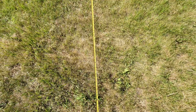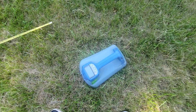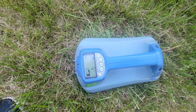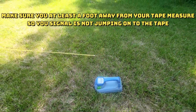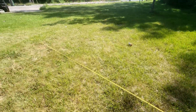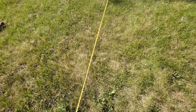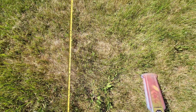I'll check my depth — I'm going to sit at the 10-foot mark and go to the box. I'm at 8 kilohertz. I'm roughly about a foot away from the tape measure — you want to be a foot away so you're not picking up the tape measure and the signal's not jumping out to it. I'm on sound mode here, and we'll set it at the 10-foot mark — here's the 10-foot mark right here, looks pretty close.